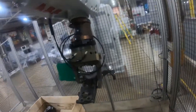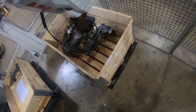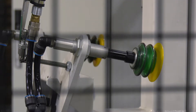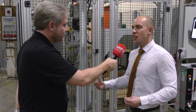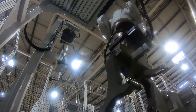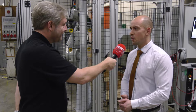This system — you've got the pallets here, but it will actually be used to machine and check in due course? Yeah, this is a test cell that we set up for a customer. This is fairly typical of the kind of things we do here. When customers have a query or something a little bit more unusual they want to try out, we can bring it here and set it up on our demo cell. We've got a table that represents a machine tending bed, but ultimately that's the easy part. The more difficult part is how do you get the parts from the pallet onto the robot arm — the rest is relatively easy. So in simple terms, you just roll up with the pallet and it'll get on with it all, and once it's finished, load it into another pallet. Yeah, absolutely — roll up your pallet, or even have your AGV, completely take the manual elements out of it.